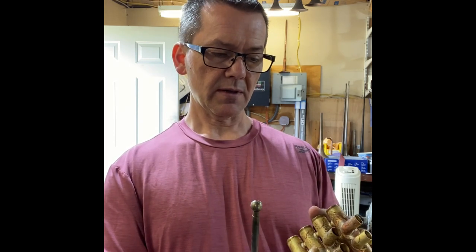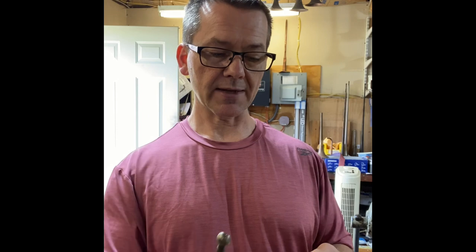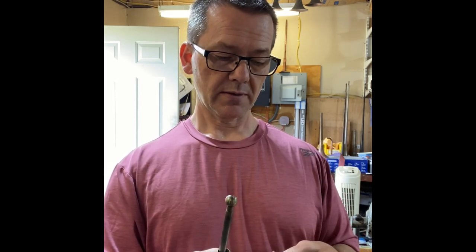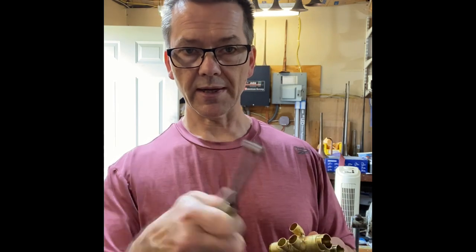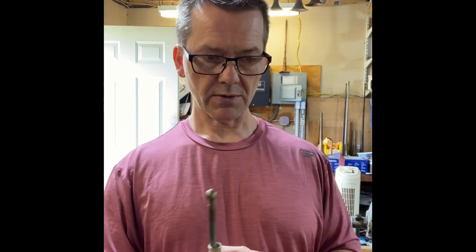And then I'm gonna straighten out all of the knuckles. Brazing, inevitably, you're going to have things move. So I go back at this point before everything is attached, before it even has balusters on it, and make sure that everything is square again. So right now, behind the camera on the bench, there are seven other casings, six of which are scraped, and two are left after this.